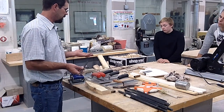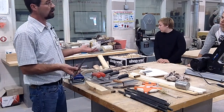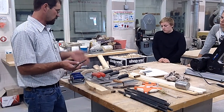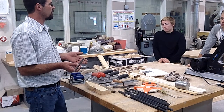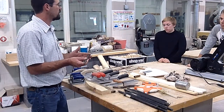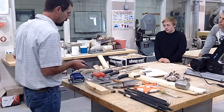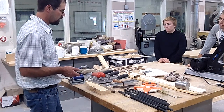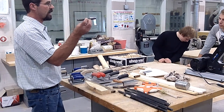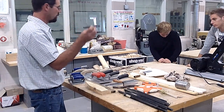If you had to cut it, you'd have to use a hacksaw or a sawzall with a metal blade, or there's a special saw, the same saw that you can cut concrete with, but it's a different blade that goes in it, or a little right angle grinder, which we do have some of in there. You could cut it real quick with that, what lengths you needed. This is one way of strengthening concrete because it ties it together.